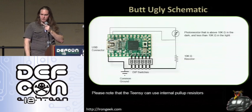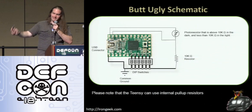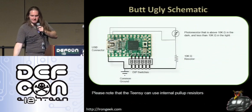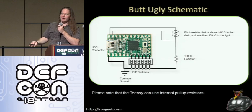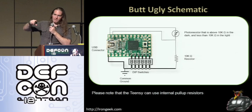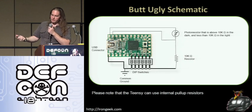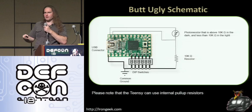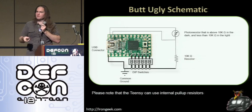Here is a simple schematic of some of the PHUKD devices I made. All you basically see is a set of DIP switches with one side going to ground — I'm using negative logic, where if it goes to ground I consider it turned on. Depending on whether a DIP switch is set or not, I can choose what payload the Teensy runs. That way I can have multiple payloads on one device without reprogramming it every time. With an eight-position DIP switch you get 256 possible different programs — that's pretty nifty.